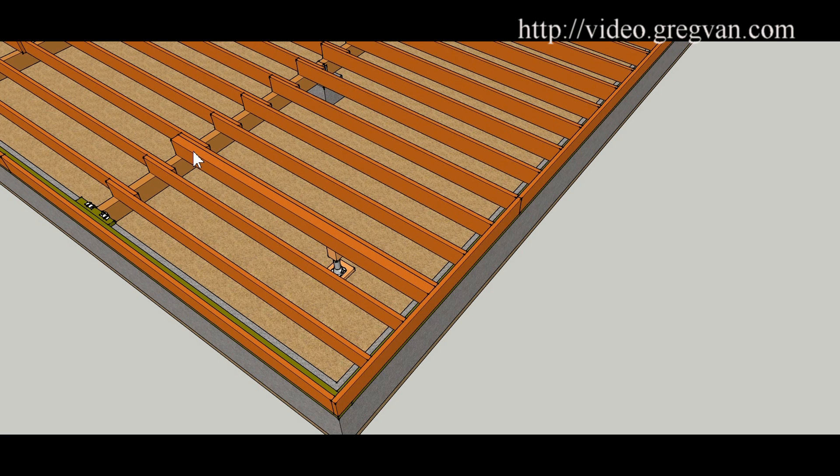Here's something you're going to need to consider: what these sagging joists are actually sitting on. If the sagging joists are sitting on sagging beams or sagging building foundations, then you're going to need to raise the ends and address the foundation - those might be damaged and need to be replaced. The same thing with the beam - if you have a sagging beam, it would need to be replaced, as it might be undersized. That would be a good time to contact a structural engineer. I can only give advice on how to make repairs; I can't provide lumber sizes or concrete foundation sizes - you'll need to get that from someone else.